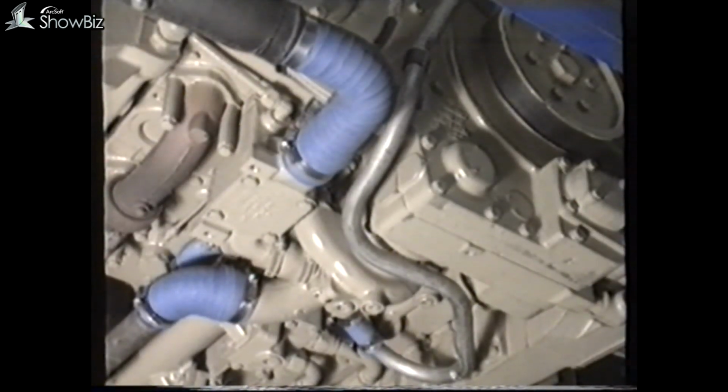If the engine is run for approximately 5 minutes, you should be able to feel the temperature difference between the engine side of the thermostat and the radiator side. The engine side should be hot and the radiator side cold if the thermostat is functioning correctly. The next stage should be combined with a road test. After running for a short period, the shutter should open, thus confirming the thermostat on the engine has opened and the shutter is functioning.